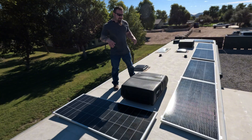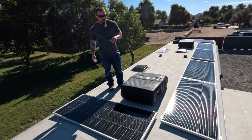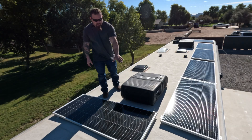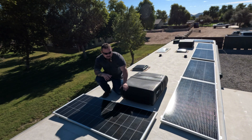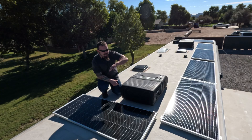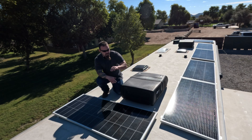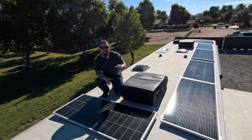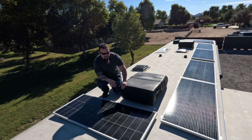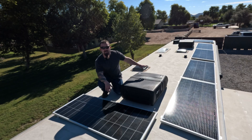Here I've set up a 1200-watt array consisting of six 200-watt panels. The configuration you wire your panels in is extremely important when spanning this much roof and getting close to shading items. With individual panels, shading takes away all the power from just that one panel. But what many people don't think about is how shading interacts with series connections. This setup is a 3S 2P — three series panels, with both banks of three set in parallel. Shading one panel in a series bank knocks out proportional power from all three panels in that series string.